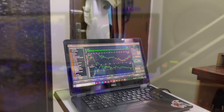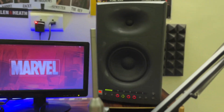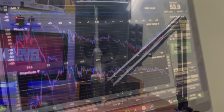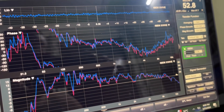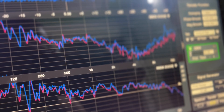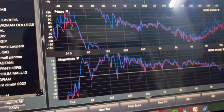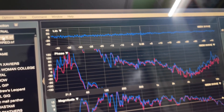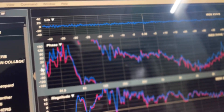Now we have a comparison between the wired iSyncon 7150 microphone and the same mic at the same distance with the wireless. We connect the XVIVE transmitter and receiver, and I have saved both plots. Pink is the wired iSyncon and blue is the XVIVE wireless. We can see that the phase is pretty similar. There is a 2kHz deviation which we also got on the linearity check — that is okay. The phase break is in the same spot, around 100Hz, which is also very nice and acceptable. The magnitude is quite the same too.